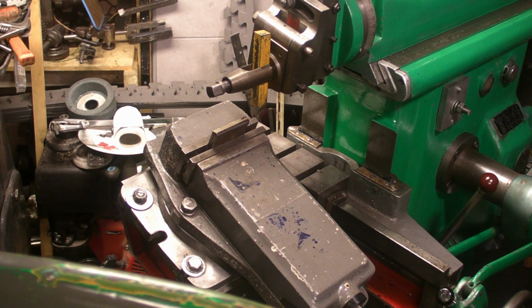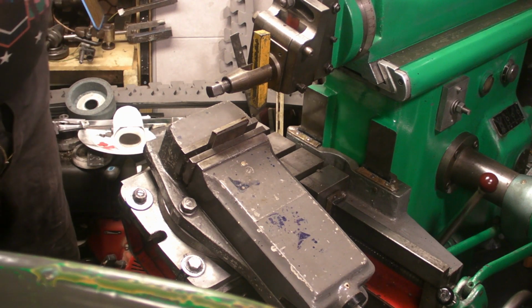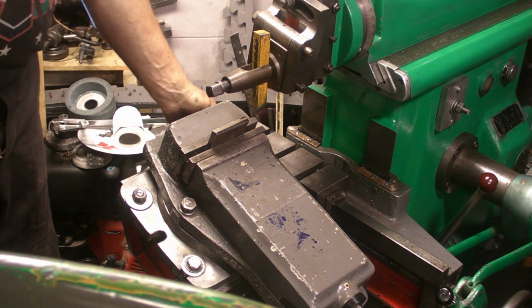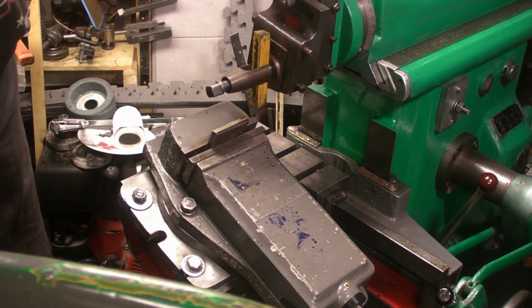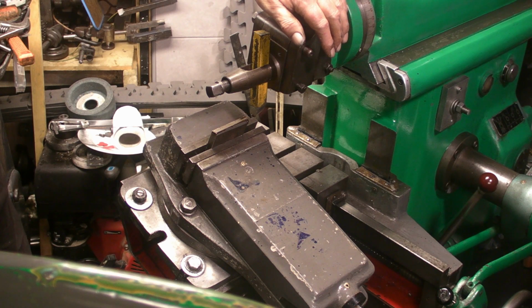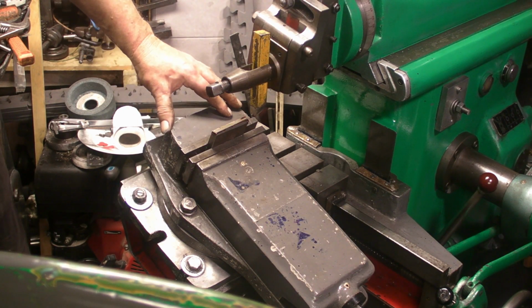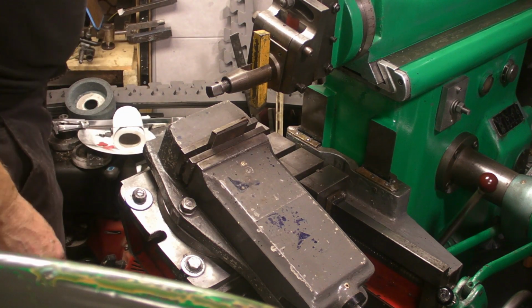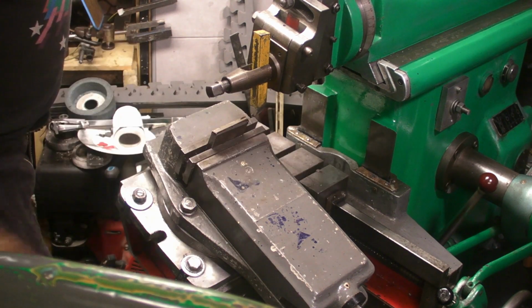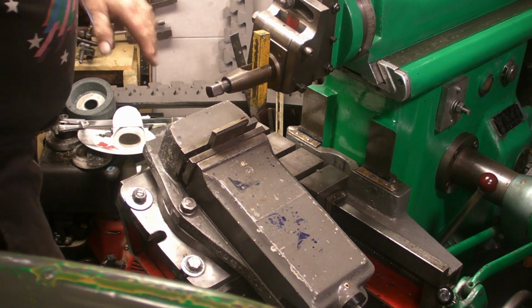Well, this is a second option, guys. I've brought the head back up to vertical position, 0 degrees, but this time I've tilted the table. It's basically in reverse of what it was on the first option. So now we're cutting horizontal, but it's the workpiece that's tilted. Let's give this one a try. Got some lube on. This time we're going to use a table feed. The vertical slide stays where it is on each pass.